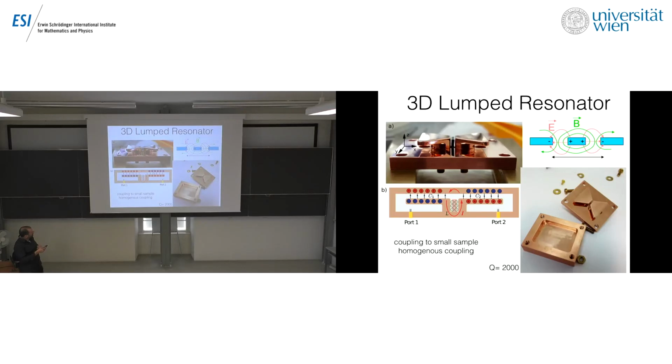You make a port underneath here, it's just a coaxial cable that ends here. This is also an advantage, because you can change that in the experiment. It's not changeable in situ. Nevertheless, if we had made these chips on sapphire, we would have to go back to the clean room, start the fabrication process, and make a new one. This one you can just screw out, cut it off, take a new one that's longer, and play with that if you don't like it. In principle we could make a motor that squeezes it in and out, so you can change it while it's cold. But it turns out for an experimentalist this is also a very good thing.